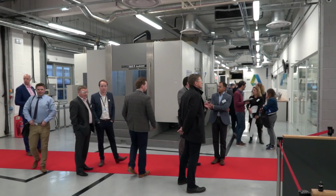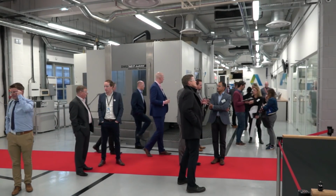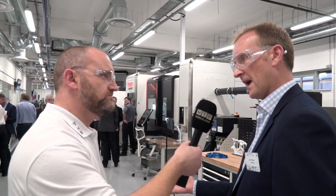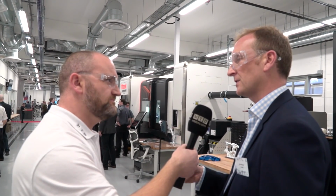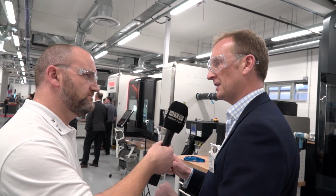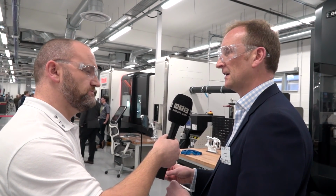There's also a machine, the larger machine at the bottom there, where it looks like it's removing weld from a mold. Okay, so a really interesting process here. If we look at automotive tooling, or many other types of tooling, often we have to do repairs on tooling, or we may actually sometimes get tooling which has initially been produced and run, some test parts have been produced, and people want to make alterations to that tooling. Now historically, the way people have done that is they have hand added some weld to build up more material, and then they've gone back and remachined that. But it's quite a risky process. In reality, you don't know exactly where the weld is that you've put down. So when you go to do the machining, it's not a very under control process.